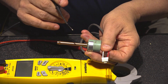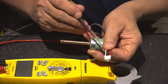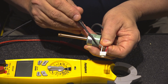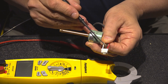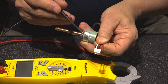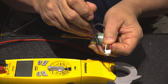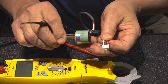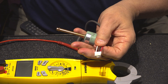For every hundred psi you go up in pressure, it's going to gain half a volt. So 300 psi is two volts, 400 psi is 2.5, and on up. With 200 being my baseline, every hundred psi I take away from that, it'll drop the DC volts half a volt — so a hundred psi would only be one volt. Pretty easily I can come over here and check on the side of the plug. I'll need a set of Molex tip probes to get in here, and I check right here on the side of the plug with this particular part energized. I'll be able to check and see what the pressures are, then compare that to the actual pressure I'm showing on my gauges.